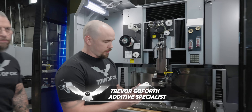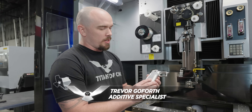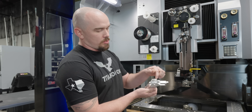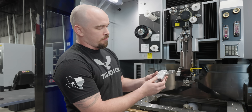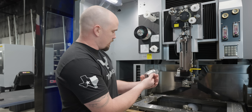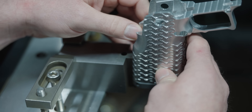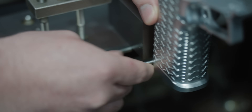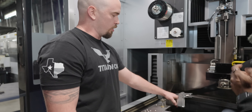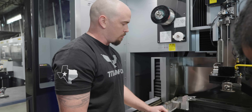So when I was looking at this part, I was figuring out how I wanted to hold it. I really didn't want to mess with Jesse's beautiful engraving or touch any of these surfaces. And I needed to have access to the mag well to be able to wire it out. So I needed it to be clear on the top and on the bottom. I was looking at it and said, well, these slots might work — I might be able to wire something out for those. So essentially you come in here, it slides down on those grooves, and we're going to stick this pin right through here. We've got our grip suspended into the tank, with access to the mag well so we can wire out our mag well.